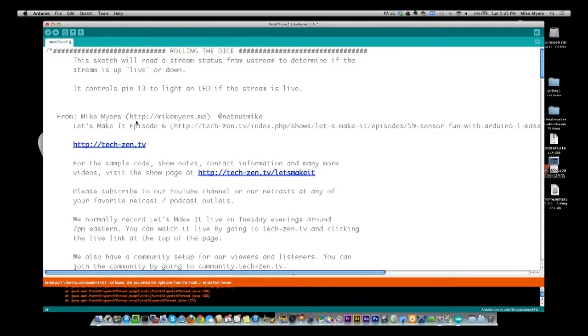The program is one of the more complicated ones that we've looked at, and it introduces a couple of additional things that we should probably talk about as well. A new library that I had to download from somewhere. In addition, the Ethernet shield works with the library that comes with the Arduino for Ethernet. So right out of the box it just worked. I thought maybe I'd need a separate library for that, but it doesn't. It's exactly the same, even though it's not really from the Arduino manufacturer. It's from SainSmart. So that's one thing to note. So okay, let's go over and look at some code. Let me get back to the top, and here's the code. And you see I didn't change the name yet.